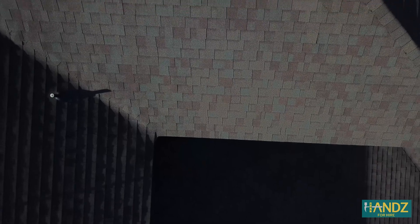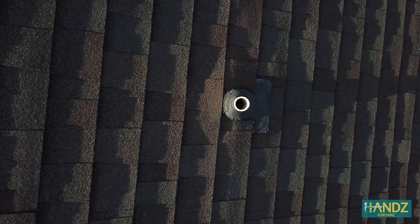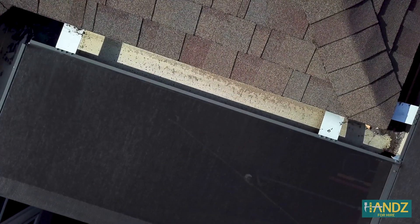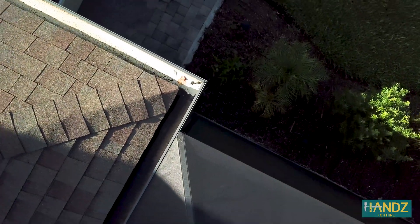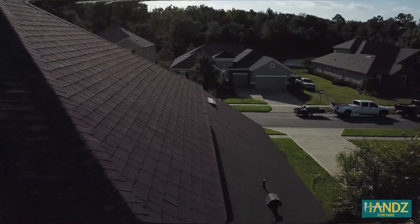I continued to move along the roof shingles slowly with the drone and zoomed in to certain spots. I tried to check the flashing and zoomed in around the vent pipes — it all checked out pretty well. When I looked closely at some of the gutters, they were filled up with some of that colored grit from the roof asphalt. Whenever you see a lot of these granules, you know Mother Nature is chipping away at your roof. This gutter has standing water and needs to be checked — you can actually see my drone reflecting in the water. We can confirm those white spots are not bird poop, so it must be some sort of plaster or caulk that dried on top of the roof. I'm not too worried about it, but I'll go check it out anyway.